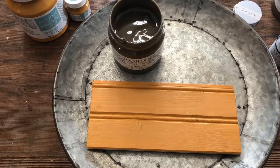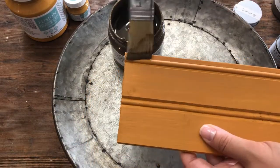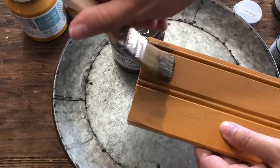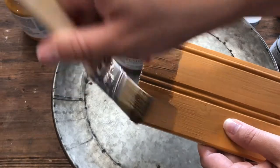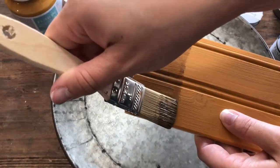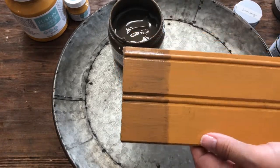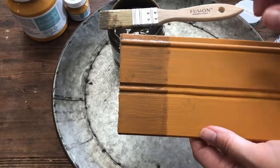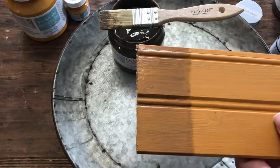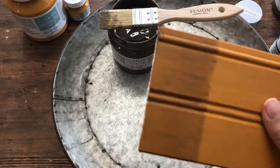I'm going to start with the antiquing glaze and just put it on solid. If this was a piece of furniture, maybe I would just highlight the details. I kind of want to show you how the glaze changes the tone of the mustard if we put it over full coverage. Whenever you're glazing a piece of furniture, the glaze does not have the durability that the paint has. So if this was a high-traffic surface, even though I glaze it, I would still want to seal the glaze. But if I'm just adding interest to detail work, a lot of times I'll just glaze and not seal it. For flat surfaces I like to seal, versus if the glaze is just settling in recessed areas, I'm not too concerned about that.